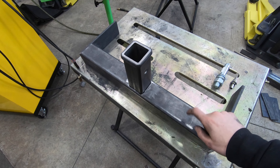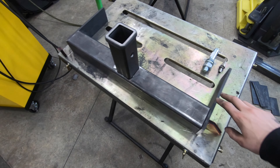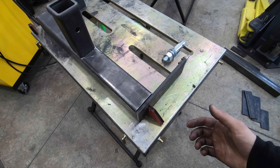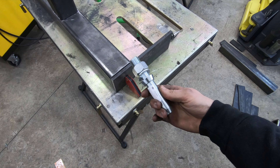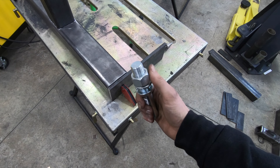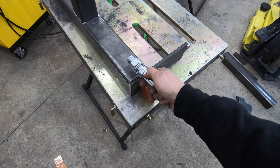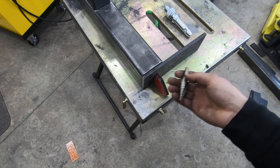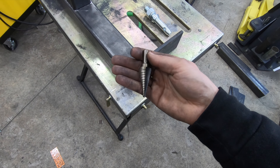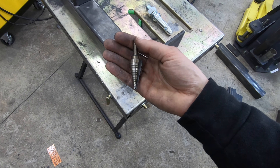Now that we have the two-inch receiver tube down through the three-inch tube, next I'm going to test fit these nine-and-a-half inch long pieces on the outside — one on each side — that are going to hold the weight bracket across the center. Before I weld them into place I need a couple of holes down on the end for the pins. These category one pins have a seven-eighths bolt on the bottom, so I need a seven-eighths hole through the side of the nine-and-a-half inch plate. I'm using a step bit — that's probably the cheapest way to get a seven-eighths hole; I'll link some in the description, they were about 20 bucks for a set of four.